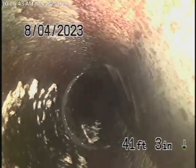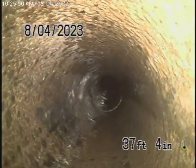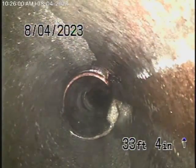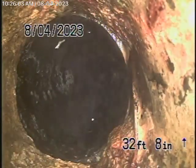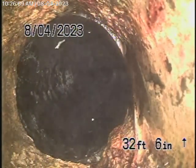The line is clear. Right over here is where the pipe exits the house — I've put a little green dot on the concrete. This is just on the outside of the back house. We're coming back a little bit in this very old cast iron pipe, and we would definitely recommend that this section of cast iron be replaced because of the dampness underneath the house.